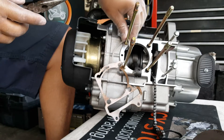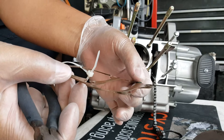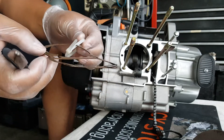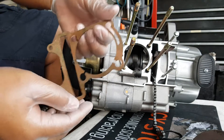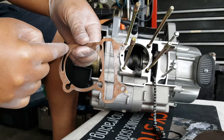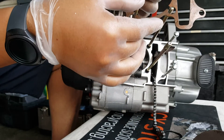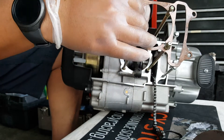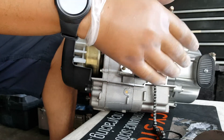We're going to cut the tie strap because we won't need it anymore. You can see the broken area is still there — this will be compressed further, it's doubled up anyway so we'll be okay. It goes only in a certain direction — keep in mind the long nose part goes down. So the breaking point is going to be facing through the crankcase itself. See it has a little hole here — that is your oil hole. It's a beautiful gasket with that nice copper color.